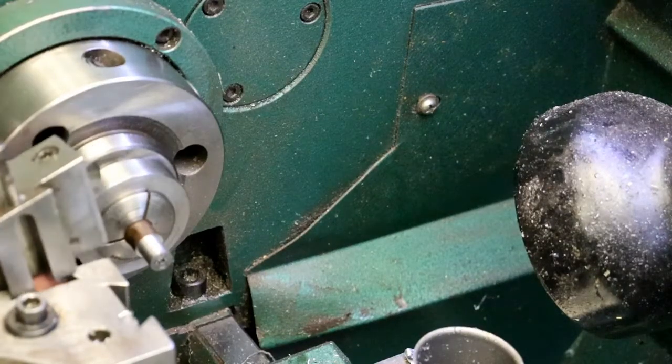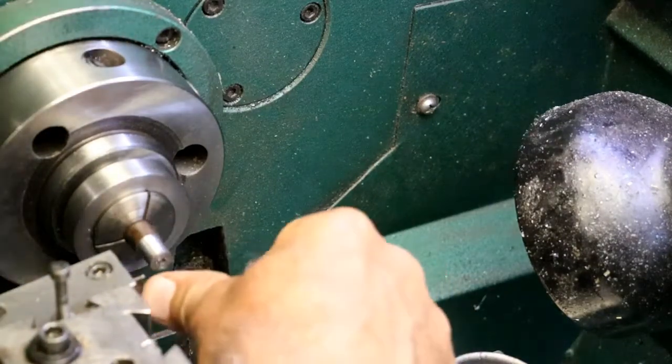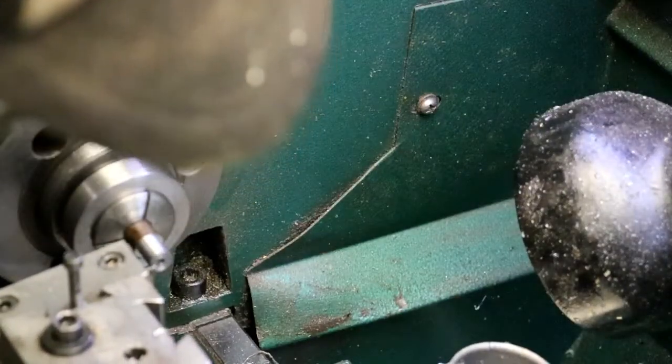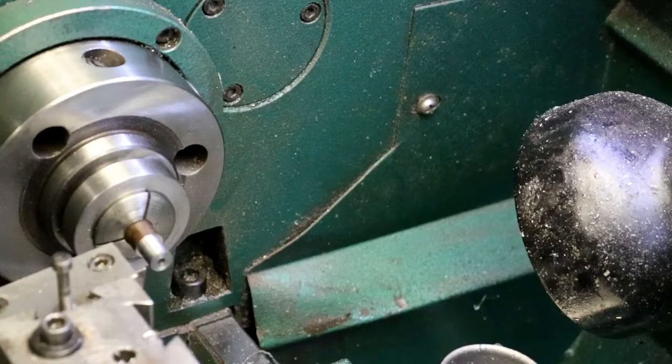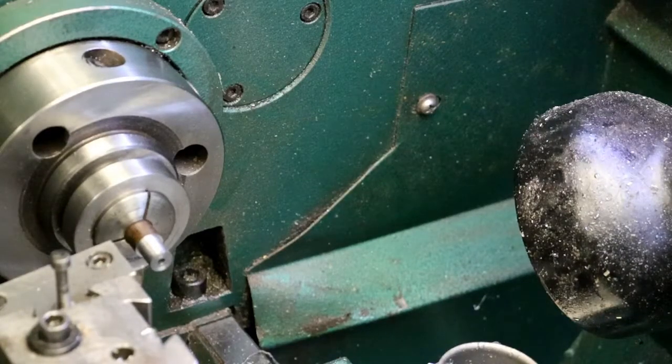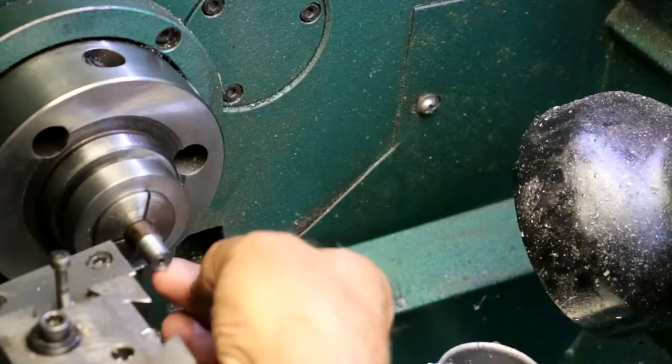This is 50 thou. All right, let's go in here and touch and get my zero. Right there. And then 50. Now, I'm going 85 from the edge, and I'm trying to decide whether I want to go a little less than that. Well, 80 would give me 10 thou, it would give me a 70 thou. I think that's what I'm going to do. I'm going to go 80 thou and then plunge in. Then I'm going to move over my 10 thou.